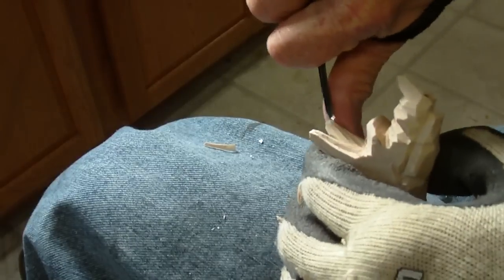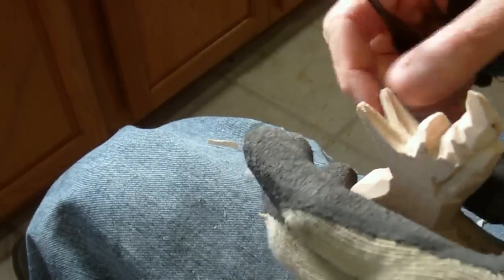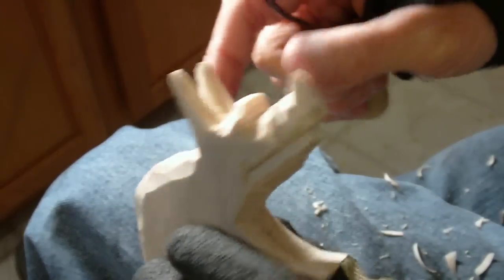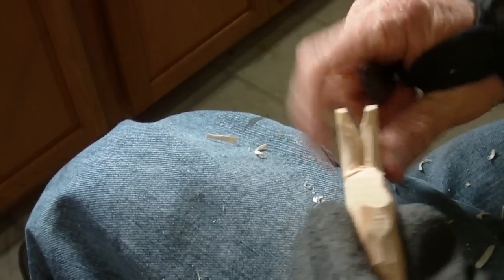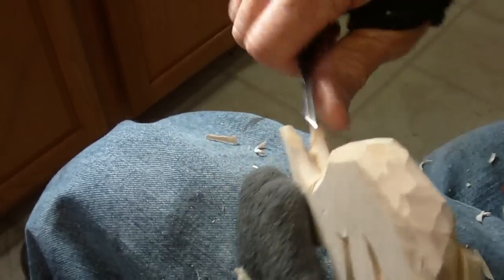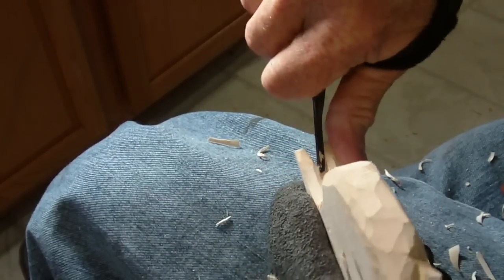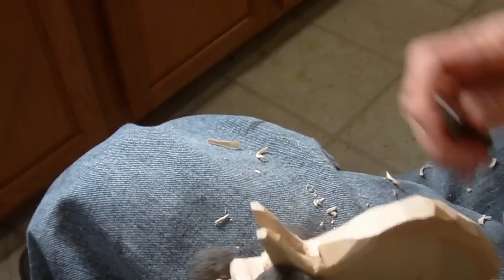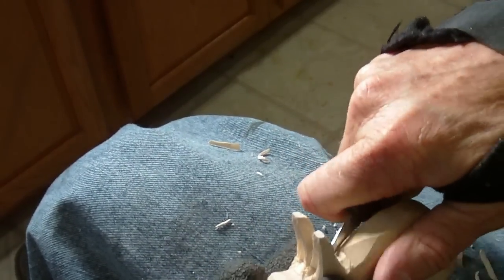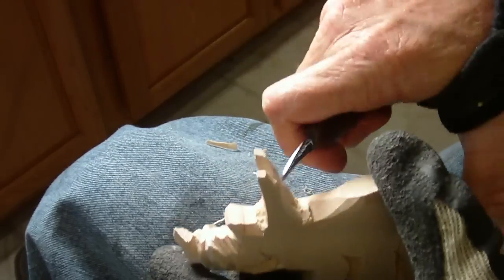If you've got a little v-tool, just kind of — take a little. I'm going to take my v-tool right here and come a little bit more in there. You gradually do it; you don't try to do it all in one thing. Take small cuts.